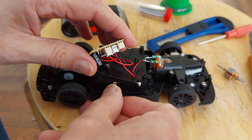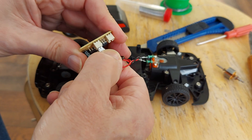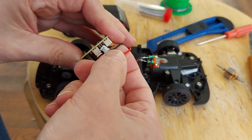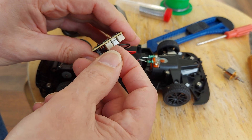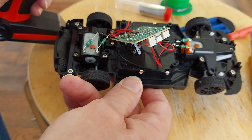It's doing something clever that I don't need it to do. And it looks like it wasn't that separate 8311 H-bridge that was causing the problem - it's the output from the controller.